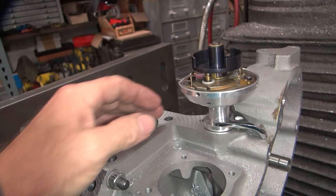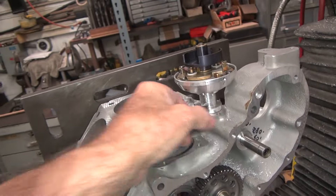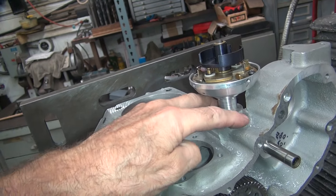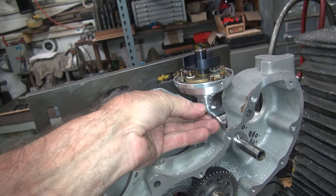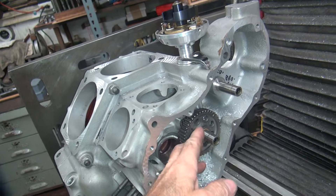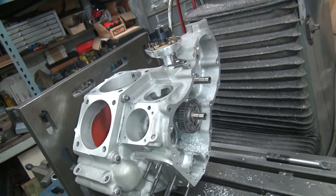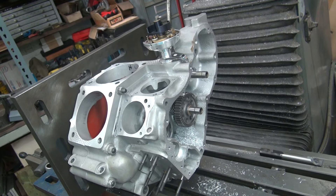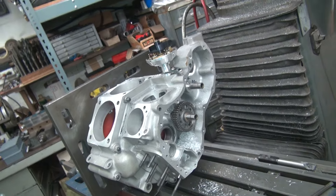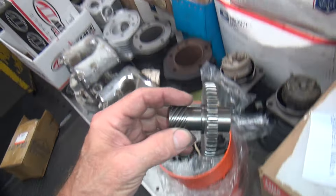I don't think that one went through, but we'll have to check to make sure. So if that's what the customer likes we're fine. If he wants the fake look, it goes around this direction with a Y-cut in a horseshoe bracket, two bolts that tighten it like a stock distributor — kind of hides the fact what you're doing, but it's still an electronic ignition so it's not exactly stock looking. Right now this setup is obviously close — it goes from zero to about five or six thousandths clearance on one side. It definitely goes to zero. With the V-twin stuff in there, who knows what it's going to be — you don't know until it's done, and when it's done you can't do anything to fix it except do the whole job over again.